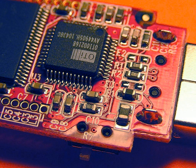Often only the solder joints hold the parts to the board. In rare cases, parts on the bottom or second side of the board may be secured with a dot of adhesive to keep components from dropping off inside reflow ovens if the part has a large size or weight. Adhesive is sometimes used to hold SMT components on the bottom side of a board if a wave soldering process is used to solder both SMT and through-hole components simultaneously.